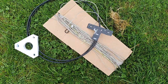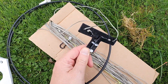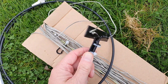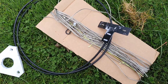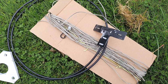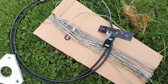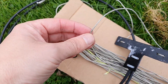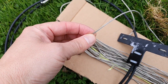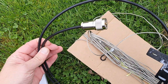These are the antenna wires. Here's the coax connection — it's actually soldered and then covered in liquid electrical tape, so it's totally weatherproofed. The wire I'm using is Nevada 28D. Originally this was covered in a green silicone coating, but I removed that for another project. It's a tinned copper braid, but in the middle it's actually Kevlar, so it's extremely strong. There's a little patch cable that goes to the chassis connector on the base plate.